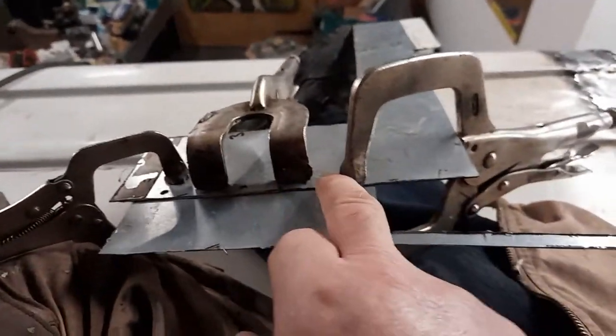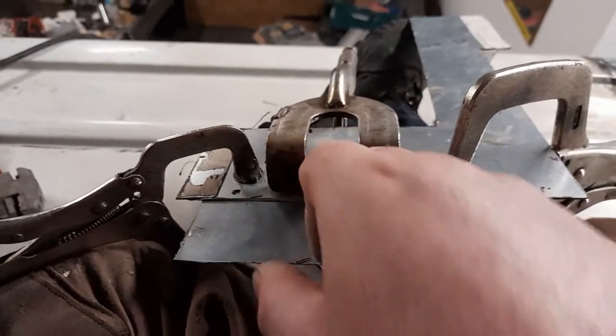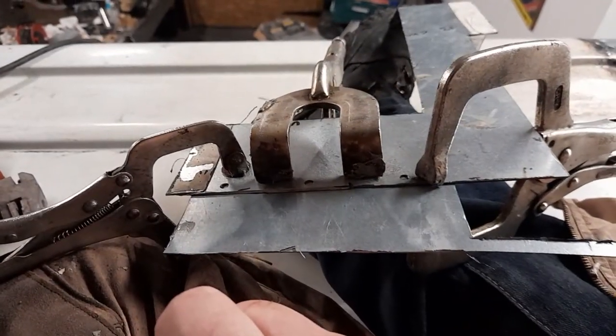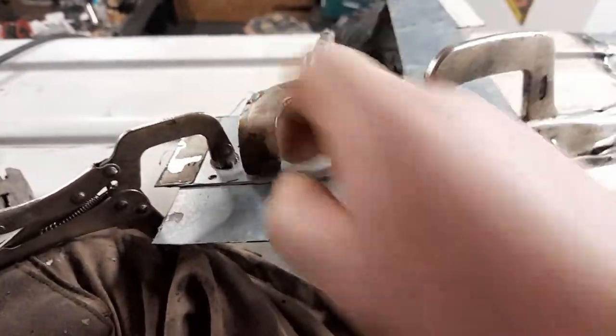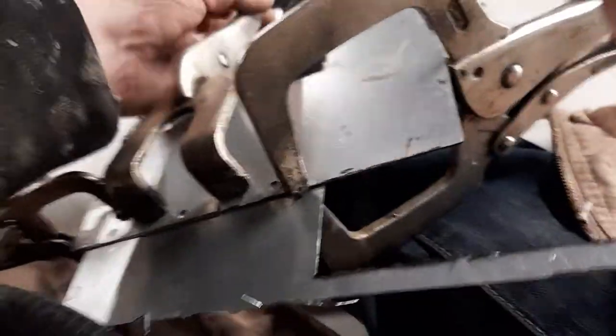So there are my welding hacks - I usually do spot welds in three or four second bursts. Now, these clamps are great for getting in between two pieces of metal and getting the welding torch in there. The fact that the welding torch blows holes in thin sheet metal - I've used that to my advantage.